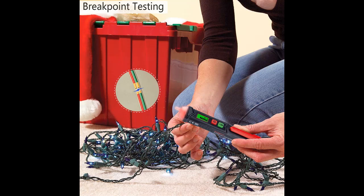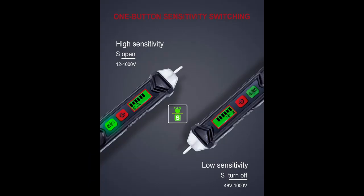Visual Voltage Indicator on the HD LCD screen utilizes up to 8 bar graphs for easy interpretation and viewing. Audible Voltage Indicator beeps at a greater frequency the higher the voltage sensed, or the closer to the voltage source. The screen lights up in red or green to distinguish live or neutral wire.